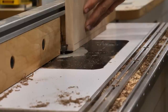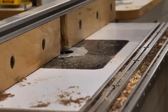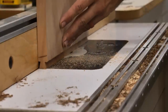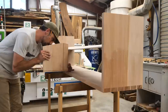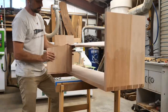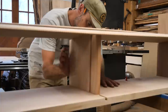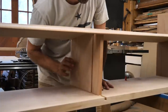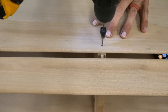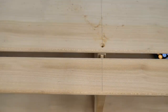We've got to cut the sliding dovetail on the center divider. I set up the router table — I made this one a little loose, which I was disappointed about, but typically you can nudge the fence over and sneak up on the fit. You can see the flex in that shelf which lets me get it in place. There's also a little dado I ran down the length of the divider that matches the gap in the shelf, so it continues that profile. We'll screw it down with some brass screws, and there's glue in that sliding dovetail.